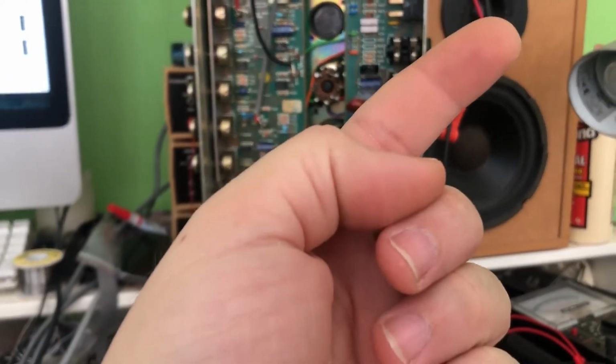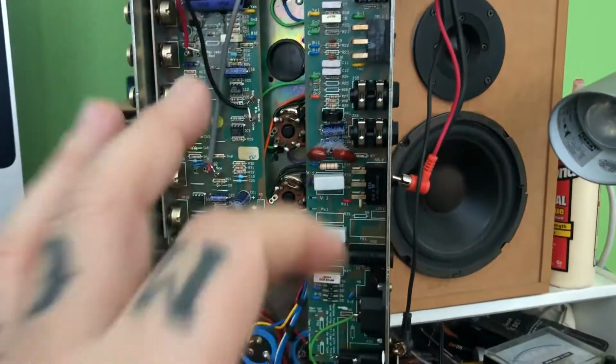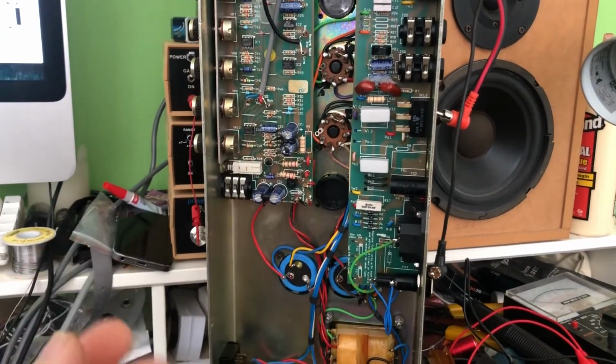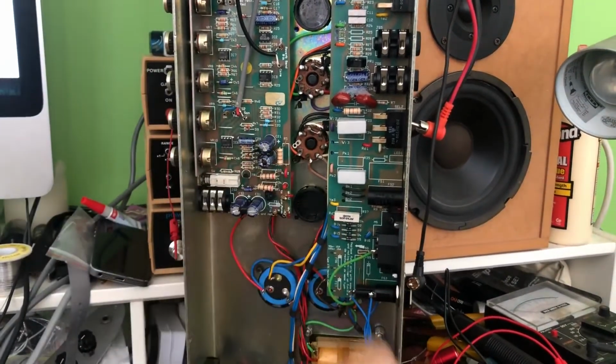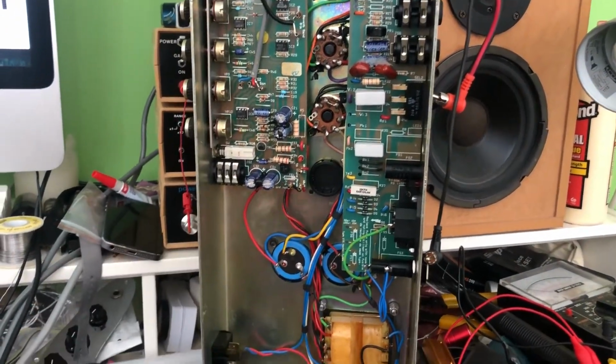So I had that JTM30 that I repaired twice for the customer. Once, actually, it might have been three times. Once it was just horrible. Everything was a mess. I recapped it anyway. I'll chuck the video up here and you can watch it. That had an X capacitor that was clamping down the voltage along with some Zener diodes for the bias, and that capacitor had failed. I don't have the capacitor here to show you.